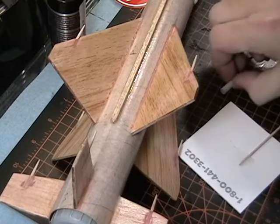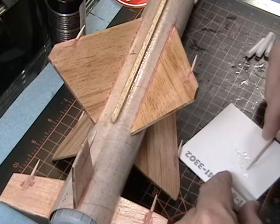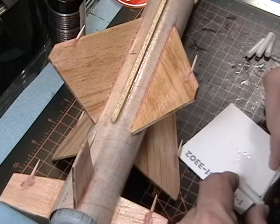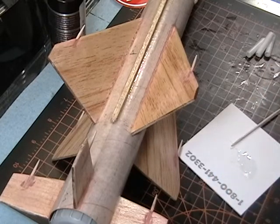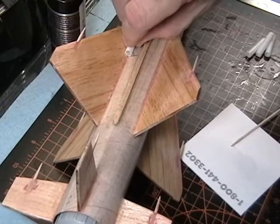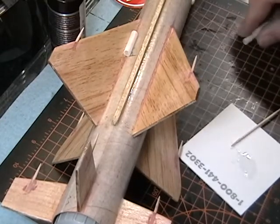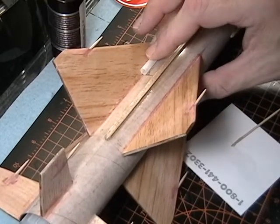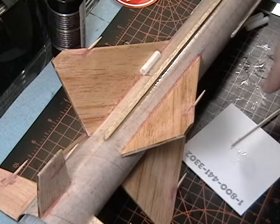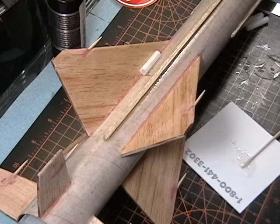Okay. Take my tube, which I've also sanded, roughened up. We'll put some of the epoxy on there. Good swath, just make sure you don't cover up the holes. And I'm going to place it with the back at the mark. Okay, I'm going to set it in there. And that should take a little while to start to tack up, and then we can actually add some epoxy to the fillet in the next step, and I will attach the other lugs.